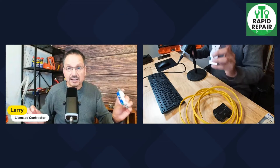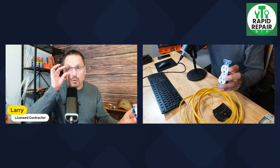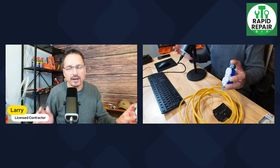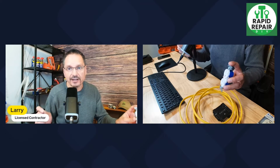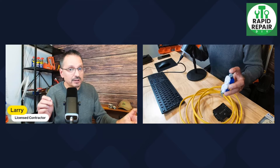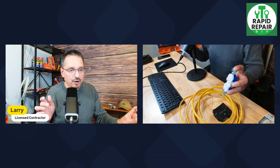It is completely safe — there is no additional safety risk at all with a 15 amp outlet on a 20 amp circuit. You can do it all day long and you will be fine. You are not violating code. There are plenty of other areas in electrical work where specs have to match exactly, but 15 amp outlets on a 20 amp circuit are good to go.